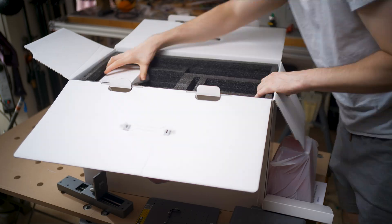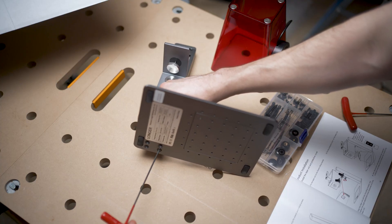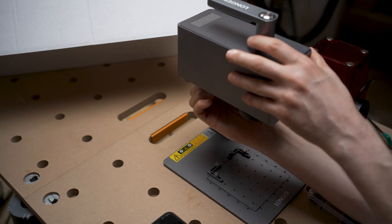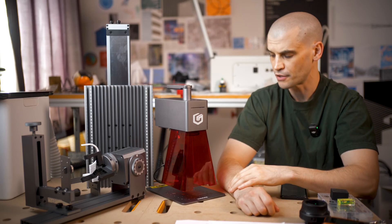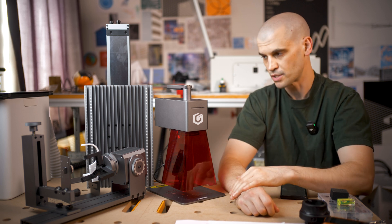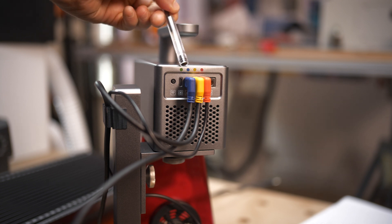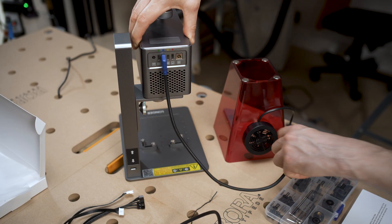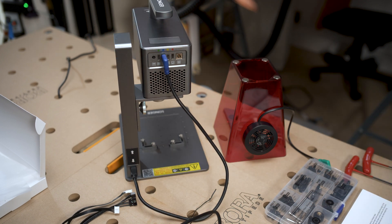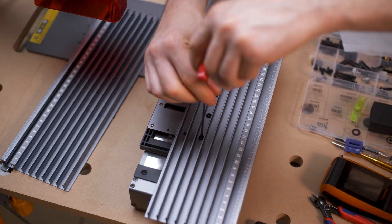Let's go through the unboxing and setting up — it was very easy. Essentially this head is secured with just one bolt to this bracket, and this arm, which has the motor and the mechanism that raises the head up and down for focusing, is just secured to this plate with four screws. At the back of the laser head you have the colour coded cable connections, and on top of the handle you have the on and off button. Putting together the accessories was very easy as well — just following the instructions and screwing in a few bolts.